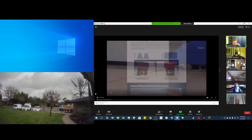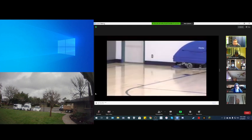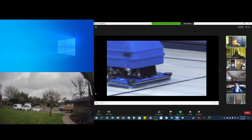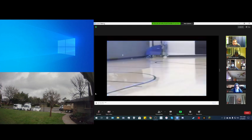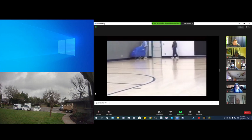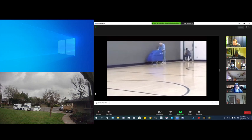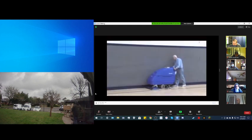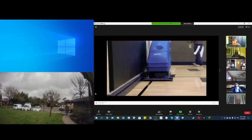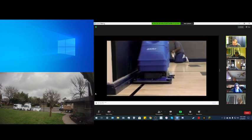Uses a pad that is rectangular, not round. It provides consistent contact across the cleaning path. The cleaning solution is introduced in the front of the rectangular scrubbing pad. Notice that the orbital action contains the cleaning solution in the pad and carries it for the full length of the pad, resulting in 50 to 70% less water being applied to the floor and immediately recovered by the vacuuming system, leaving the floor virtually dry. Though the floor may have appeared relatively clean before, take note of the dramatic difference between the floor and the path Dave has created using Certec's LF-150 heavy duty cleaner and the Boost machine combined.